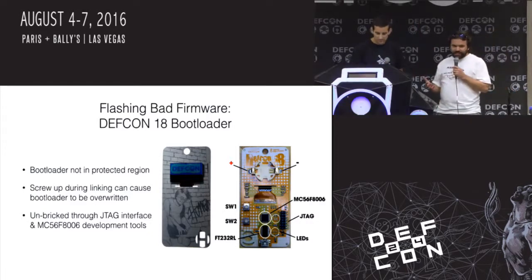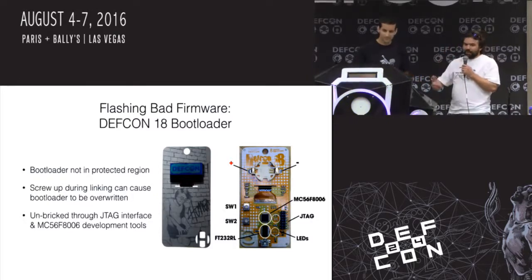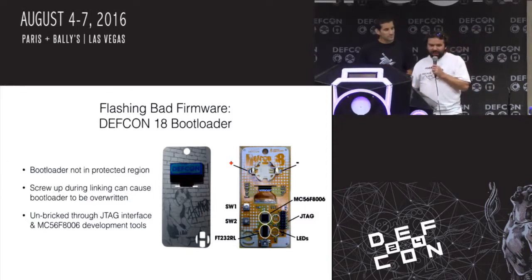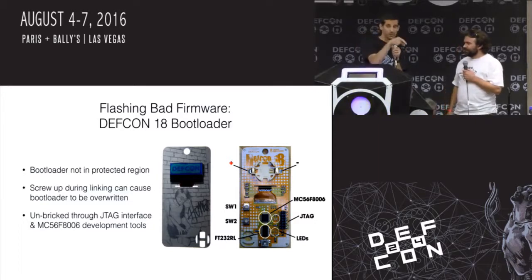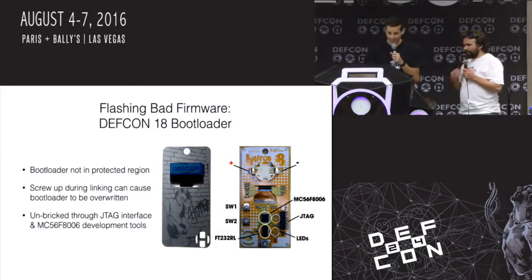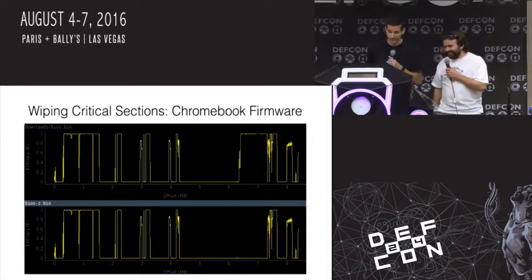Yeah. And like most devices start their life as a non-functional block of something that gets programmed by a manufacturer. So there's got to be a way to get something that doesn't have any code on it to get code on it. And JTAG's usually that way. And usually you would use JTAG to load the bootloader and then the bootloader to load your code. But if you brick the bootloader, then you got to start all over again. Or you just buy a new one. Yeah, or get someone else to buy a new one.